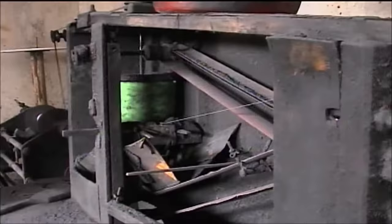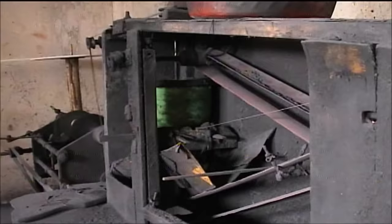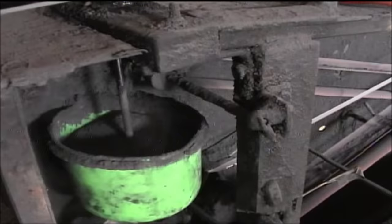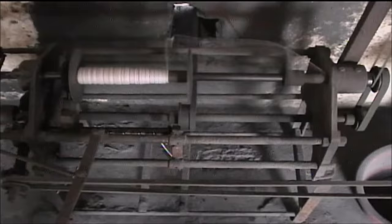Overflow from the filling process is caught, and two red conveyor belts transport the black powder back up to the top of the green reservoir. After the paper strip receives the thin trail of black powder, the strip is fed through an orifice which starts the roll of flat paper into a tube. The spooling section of the machine continues the twisting process as the fuse is wound on a spindle.